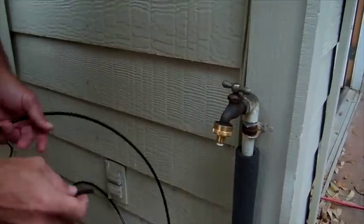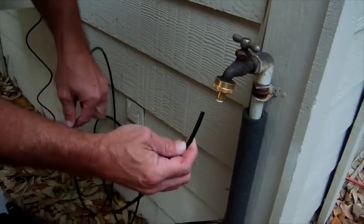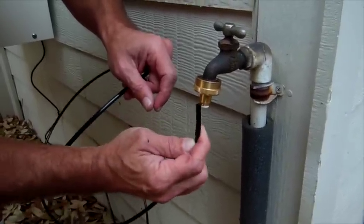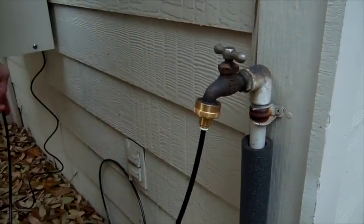Turn it off and come down through. I've cut a piece of tube that is plenty long to reach to the hookup inside the machine. To install this, it's just like you do your nozzles or any of your other fittings — just a push-to-connect fitting. You're just going to insert it all the way in, push it in positively, and you've got a good connection. It's not going to leak.